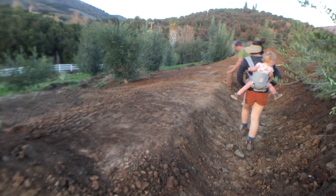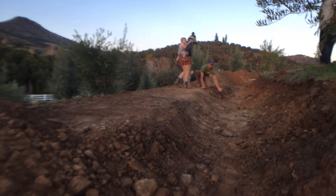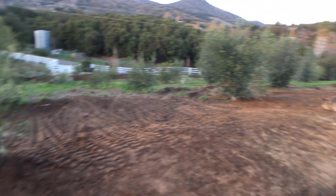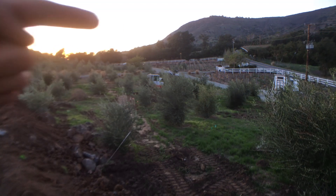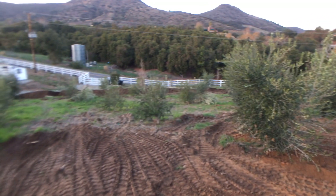This is our approximately 45-foot spillway on the east olive top swale. We set it one foot higher than the bottom so we'll have a foot of depth holding in here, and once it gets past that it'll gently transition over and sheet down in a really broad, thin flow. There was supposed to be a third swale right down here, but the excavator got stuck and that swale didn't happen. The system will function just fine with this one and the lower swale we had planned.